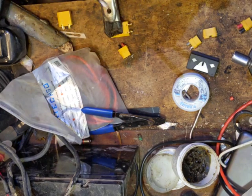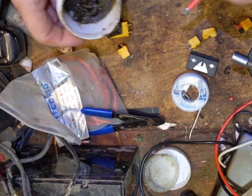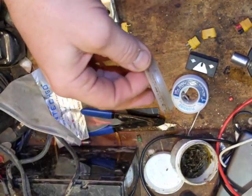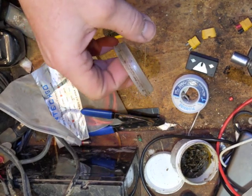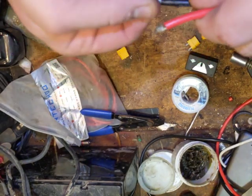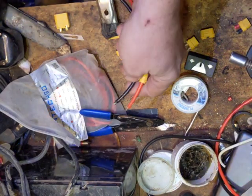Grab our wires like that. They're very fine stranded — we're going to just dip them in the solder. This container comes with a pop-in lid and a regular screw-on lid. That's so if the solder gets warm, the rosin paste solder will just flow. If you leave it in a warm car, this keeps it from getting up against the lid and making a mess. So you just take this — you'll probably want to wash your hands after — but you do that because when you solder them they're going to end up being rigid.